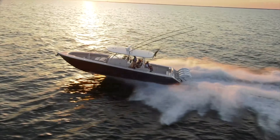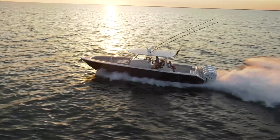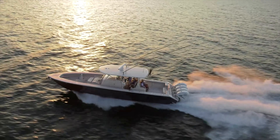If your boat is equipped with triple or quad engines, you have the additional option of setting the trim for the center engine or engines differently than the outside engines. This helps ensure you can maximize your boat's performance.